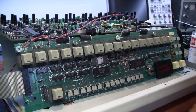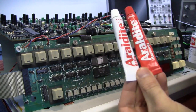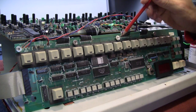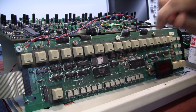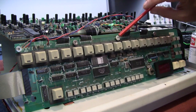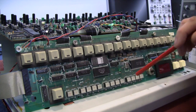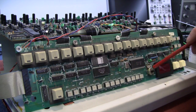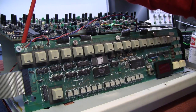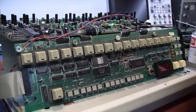I've come to the conclusion the only way to stick these posts back down is with a bit of good old Araldite. It's been done before because there's already glue on two of them, so it's already been repaired. Obviously, over the years of bashing away at these buttons, wear and tear has pulled all these tabs off the main casing. The top ones are fine because there's no pressure being put up there. I'll have a go at the Araldite and put a bit of packing behind the board when I assemble it, and that might hold it all together.